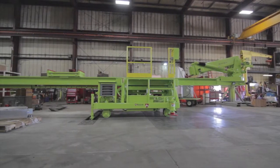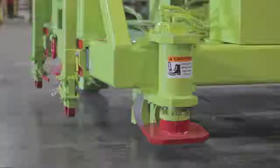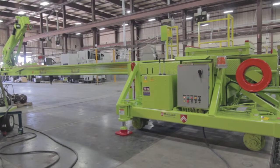One of the options of the McClellan liner handler are front hydraulic jacks. To deploy the jacks, move the lever until they make contact with the ground firmly and then stop. Do not lift the machine completely off the ground.